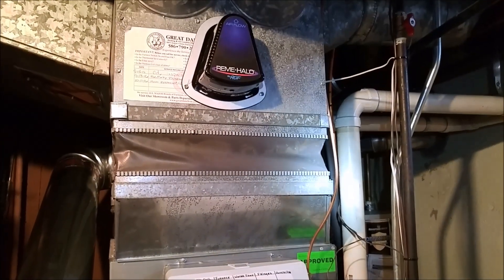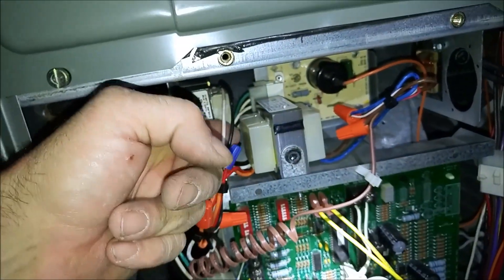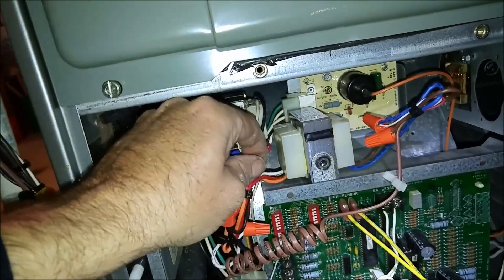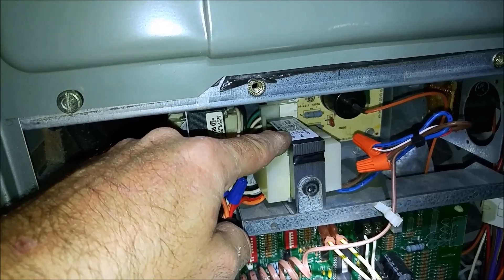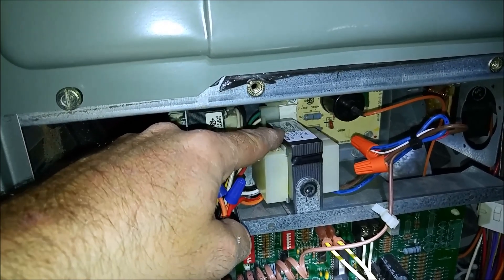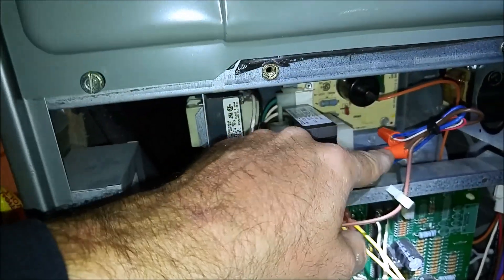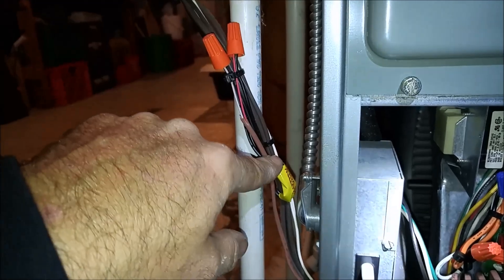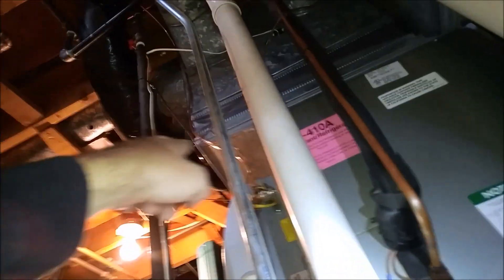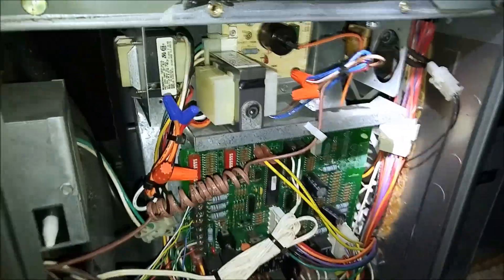Here we are. Put my transformer right here, tied into my power off the board from my other transformer, so it's got constant power. It is a multi-volt transformer. For 120 volts: black and white. So I got my black and my white hooked up, and wired my other ones off. My secondary — it doesn't matter which wire is which. I had to extend the wire because the wire that came with the unit only ran to about here, and it's way up there. Now let's get some power to this thing and she's off to the races. That's it for installing one of these.